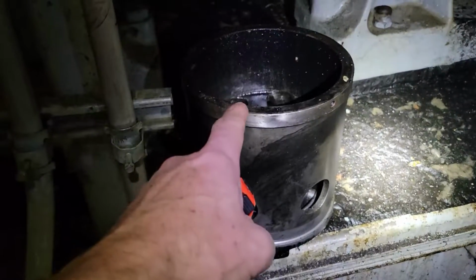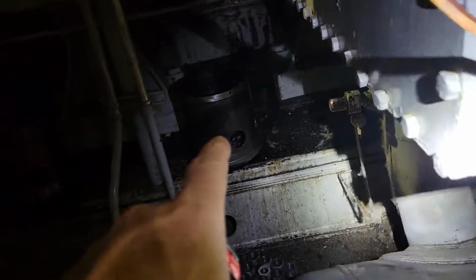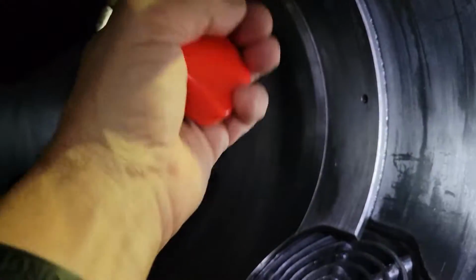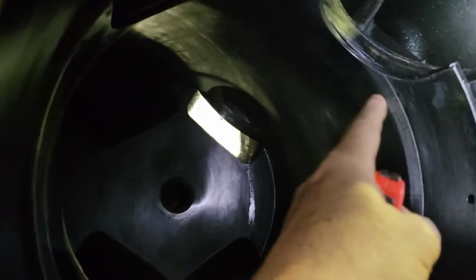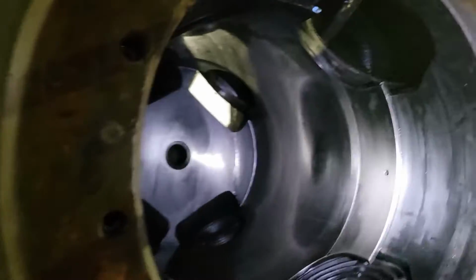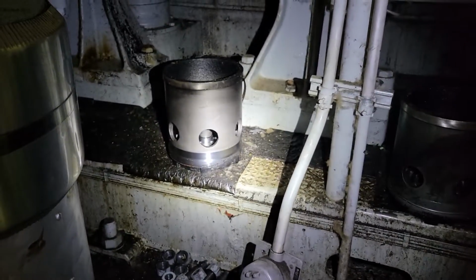There's where that's your carrier for your suction valve. That guy there. Up in here. It's right up in there. Over there. And valves, whether they're suction valves or discharge valves, it's just a series of rings. They're a synthetic material, spring-loaded. They only allow the gas to pass one direction through them, so they're essentially a check valve.